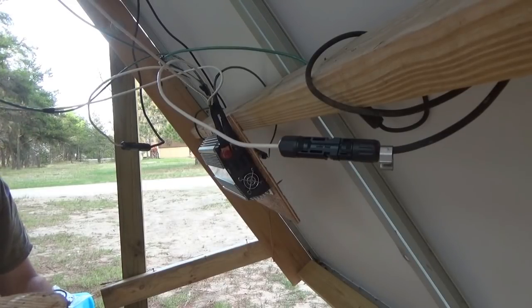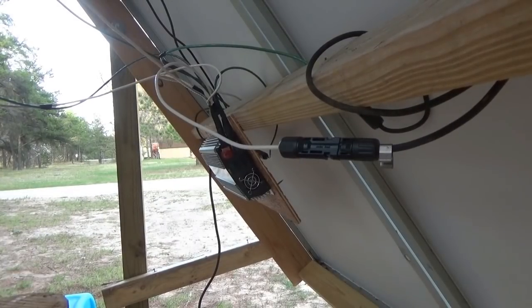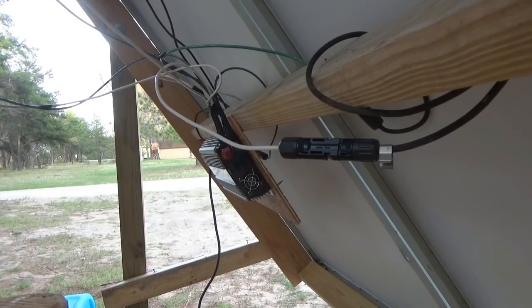I think I should be able to plug this in and see if we get power. I'm not getting enough power to reach the cut-off point — this is set for 30-volt panels and I'm not getting anything, so I don't know if it's because the sun is already set or what. We'll wait and check it in the morning. I've got plus to plus and minus to minus, so we'll see what tomorrow brings.